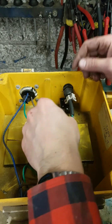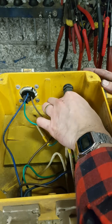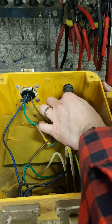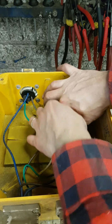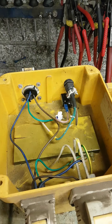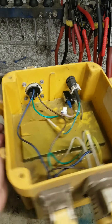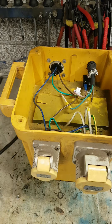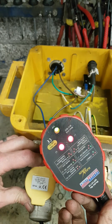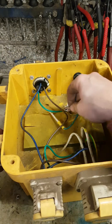That's a heavier gauge wire as well — 2.5mm. Leave it overkill, I'll make sure it doesn't melt again. See if we get any sparks this time. Now we've got a hum on it — good to go. That's all, just one broken connection.